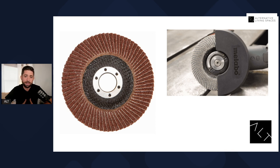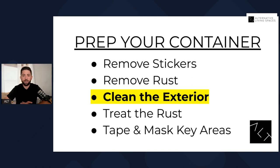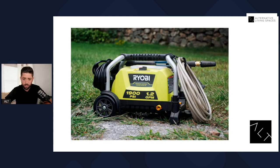When you're removing rust, you do want to take it down to the bare metal — you want to see all of that rust not present anymore. After that, you're going to transition to cleaning the exterior of your container. This is a step that could be really simple. You can use something like a sprayer. When you get up on the rooftop, you're really getting everything off — making sure you're getting in the knuckles, the under rail, basically on the bottom of the container around the perimeter. You want to make sure all debris from your grinding is removed as well as any dust, because if there's dust and debris on your container when you go to paint it, the paint simply isn't going to stick as well.